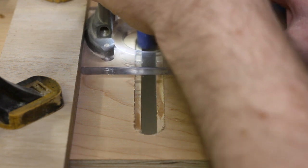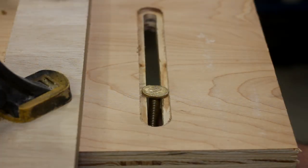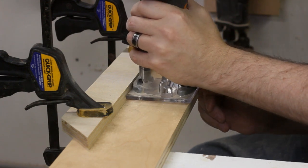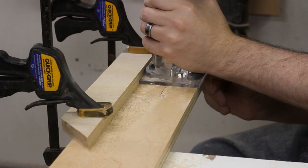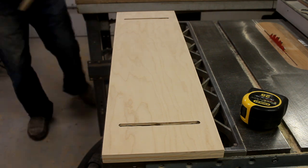And just like Wilson in Castaway, the project starts to drift away from me. The top piece gets another two routed grooves, just like the bottom piece did, but they go in the other direction. So I just clamp down another fence and work my way through. The bits I have aren't plunge capable bits, so I drop the router in on an angle as I move it down the fence until it rides flat, and then I just backtrack to clean up the cut. Once the grooves were cut, I did some light sanding and I was ready for the next step.